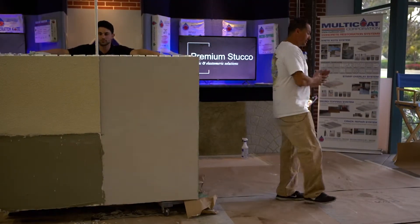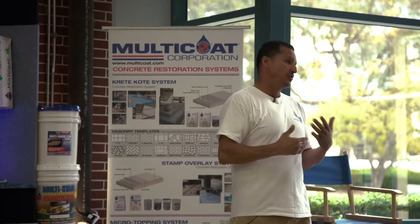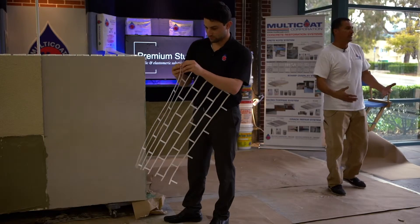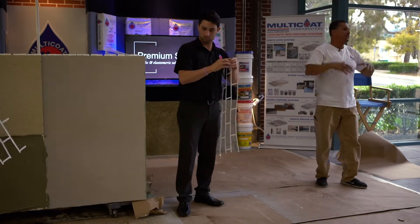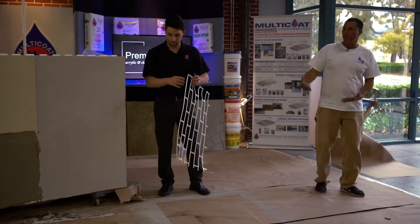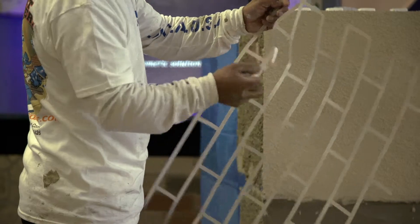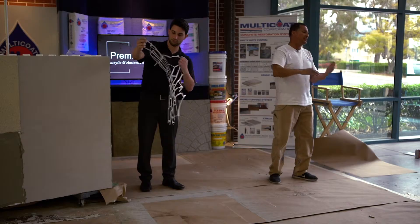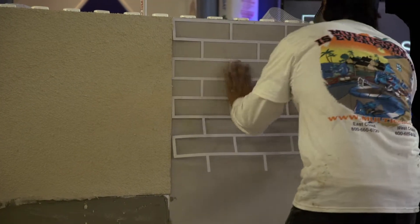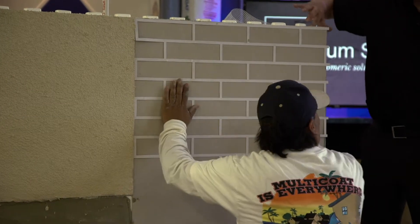On this panel, we're going to use our stencil in conjunction with the stucco to create different finishes. For example, with foam construction — where the entire house is built out of foam — you can use our waterproofing below grade and our stucco above grade. If you want the bottom three feet of the house to have a flagstone or brick pattern, instead of applying actual brick or flagstone, you can use our stencils and stucco to get that same look.